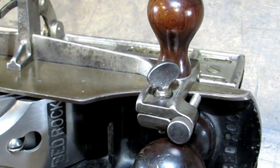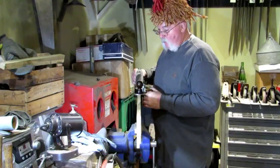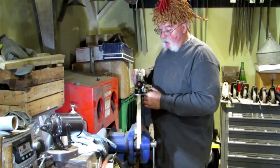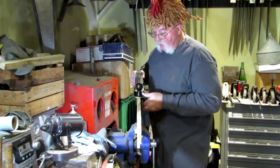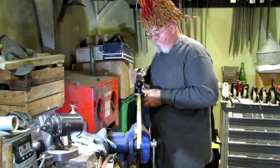I've selected a piece of poplar that has the jointer marks on the side from the modern electrical jointers, so it's a little bit rough. I'm going to try to square it up with the 605 and the jointer gauge. I checked my jointer gauge with a square and locked it in place. Now I just need to make sure I hold the fence flat against the side of my board that I'm joining and go ahead and run it across. I'm skipping over the high spots.